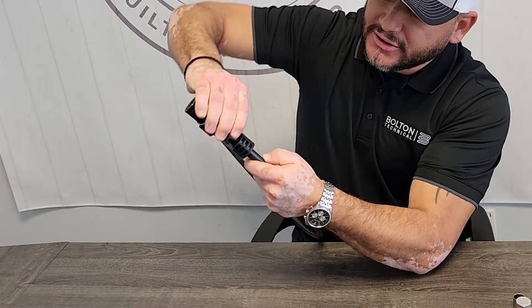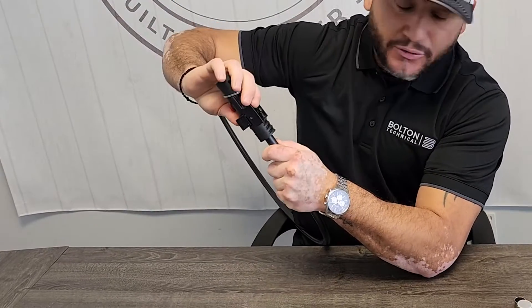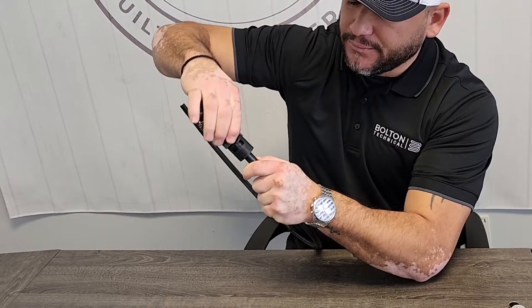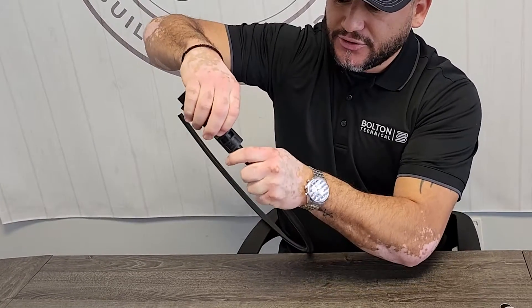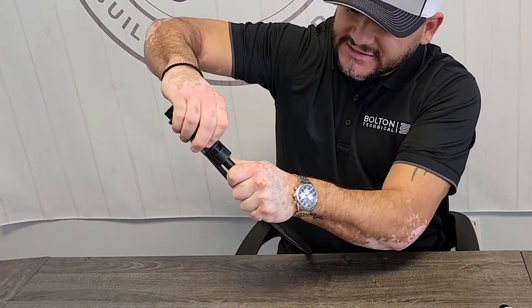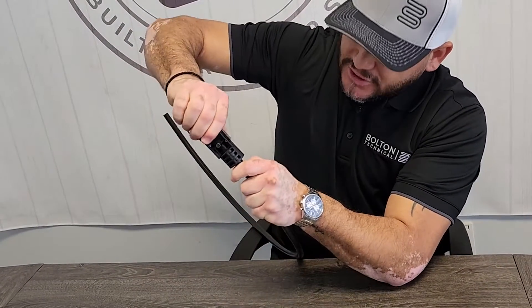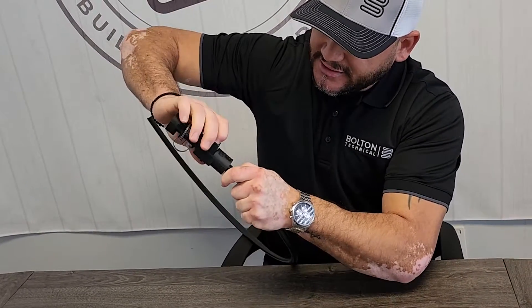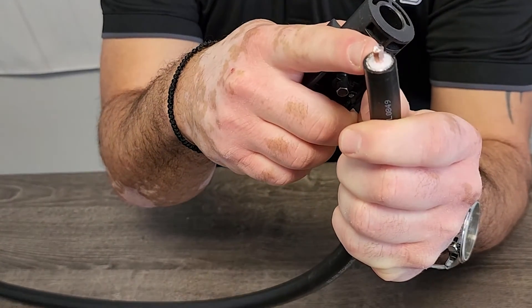I'm just going to press down and turn — do a full 360 turn all the way and then go all the way back. You can do this either way, just make sure you do a 360 turn. As I'm turning, the cable will be cut accordingly, and when I feel I've got a good cut I'll press the exit out. If it gives you any pullback that means the blade didn't cut well, so apply more pressure, get a solid cut, pull out, and you have a correct prep for the connector.